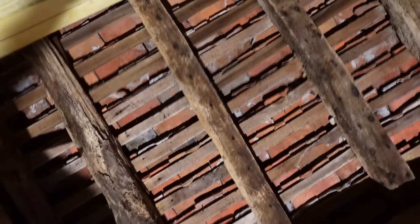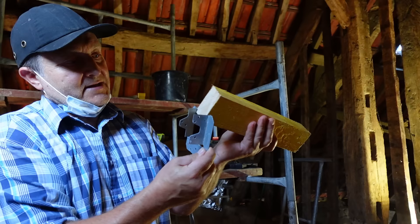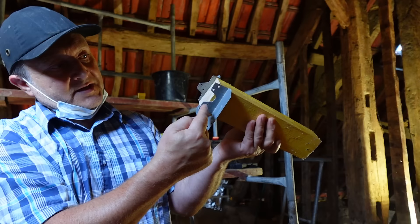Let's concentrate on this side for now. I'm going to get the scaffold in closer and put another bracket round here. I'll get it fixed in place and then we'll see about putting extra rafters along here. This is our cross brace — our purlin. This is the bracket that fits on. It simply slides over and I'll get a fix in into the A-frame and then a fix in on the side. It doesn't hold any real weight but just keeps it securely in place.